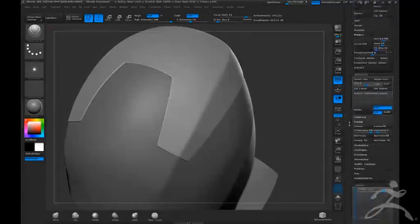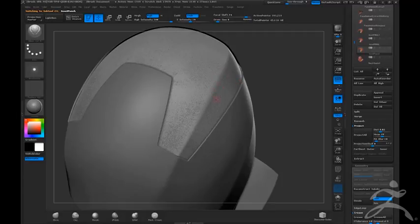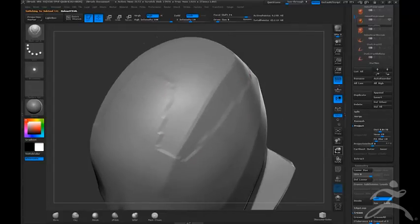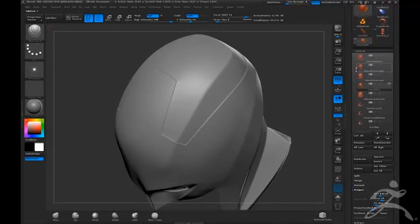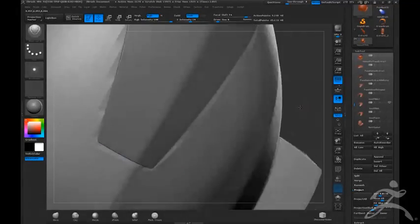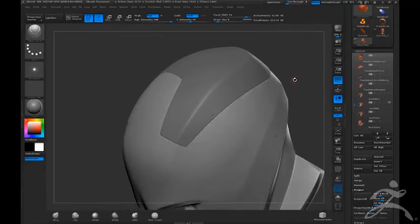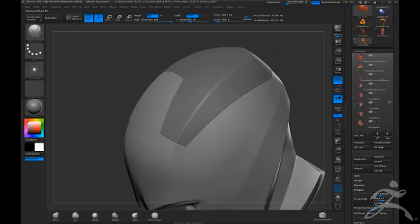Then I will invert it, as you saw before, create our Inset Punch. Now when I project to this one, is what gives us the properly clearanced inset for our panel to sit into after it's been printed. So now that's taken care of. Let's go and turn on our final panel and zoom in. You can just see that little bit of clearance around there as it comes out. See our clearance, the little line of clearance right there? It looks really small, but like I said, based upon the thicknesses of paint that your paint guys are telling you that they lay on, or are going to lay onto it, that should be enough. That's approximately 10 thou of clearance right there.